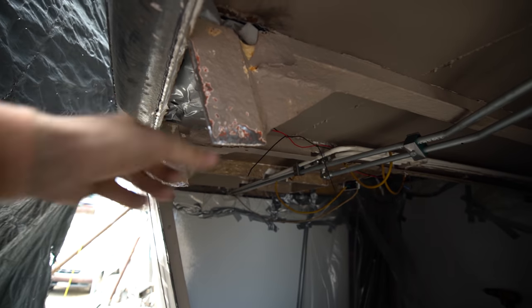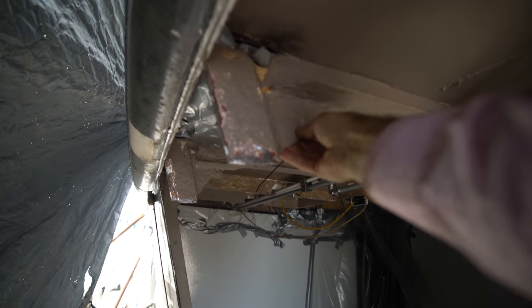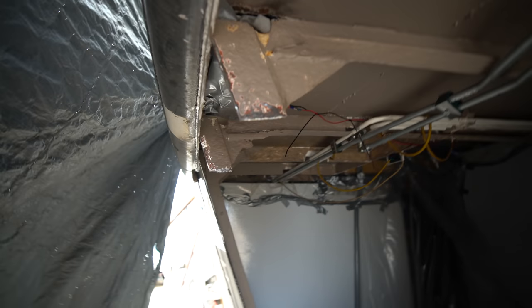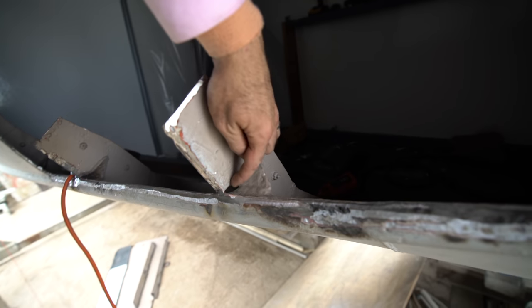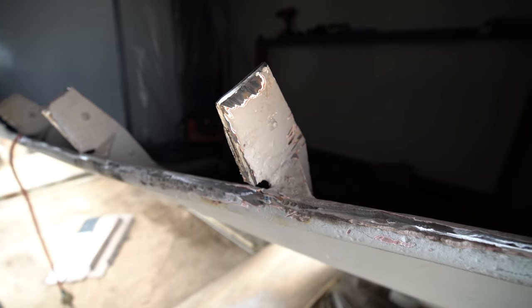The ribs - we've ground these back and they're weldable now. However, I think we'll replace these gussets - they're not big enough, too much is gone. I want six mil gussets and these are probably below three, so we'll get rid of that lot. We'll probably just take this whole rib out, start a new rib right from the top, and put a new gusset in at the same time. We can also modify the shape up the top so we have access to weld it - we'll bring the rib down a wee bit lower. Exactly the same down the bottom - you can see the original rib had that gap so they could get a solid weld all the way around. We'll basically duplicate that, copy the half round that they cut into the originals, on all areas where we have to get in there and weld.